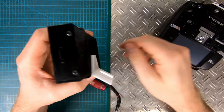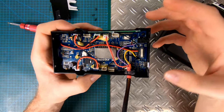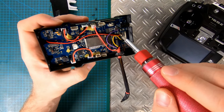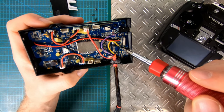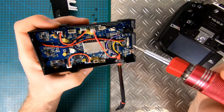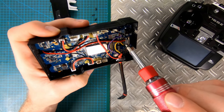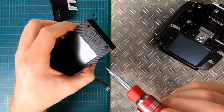Let's open this up. As you can see, it's just the board of the Nirvana from Flysky, and I routed some cables inside. This cable up here is your trainer port connection. The black one is your ground. The cable going up here is your power, and the yellow one is actually your Crossfire data port.